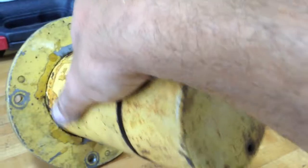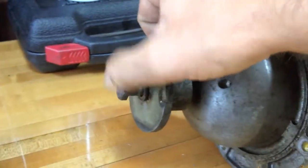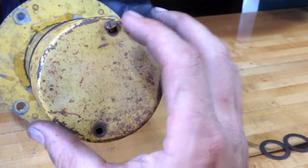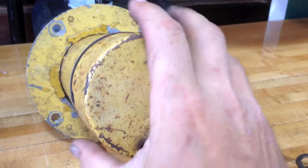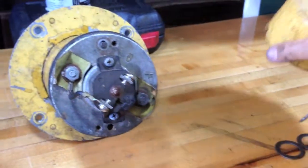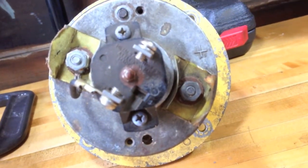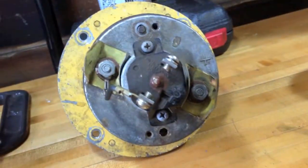It's got four bolts here that hold it to the mower deck, and then the blade goes right on here. So I took the blade off, took those bolts off, got it out of the mower deck, and then it has kind of a cap, which it only had one screw — it was missing the other. You pop that cap off, and then underneath there are your power connections. Two wires went to the power connections on there.